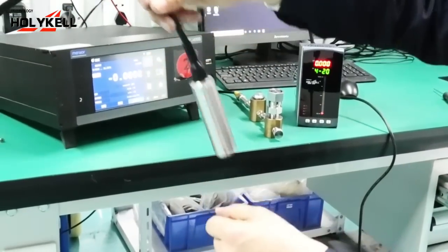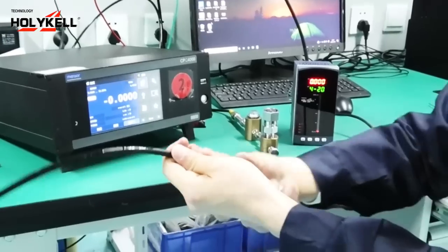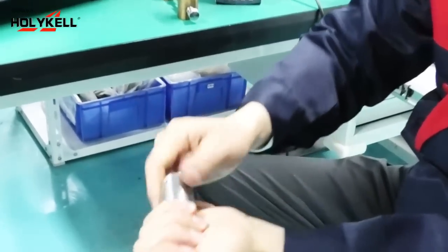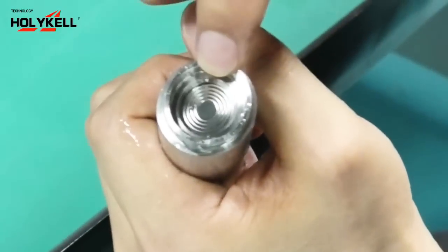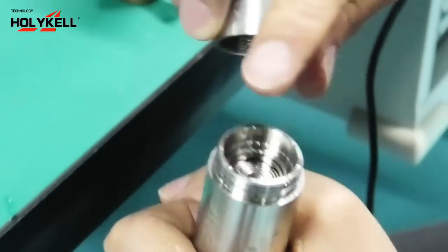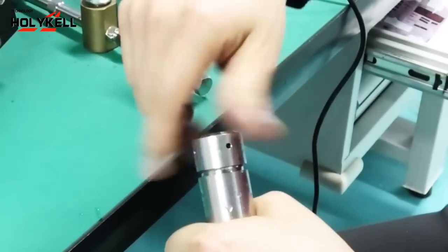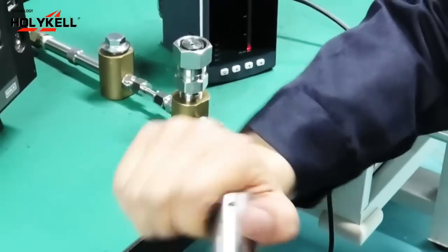Please remember — I am removing the plug from the tank. Before you check the sensor, you need to check whether the diaphragm is damaged. You can open the bleed cover and check the sensor diaphragm to see if it is fine or not. Do not use your finger to touch it, because the sensor diaphragm cannot be deformed or have its shape changed.